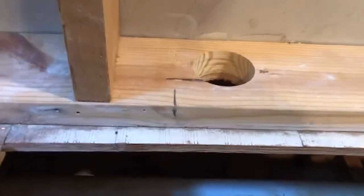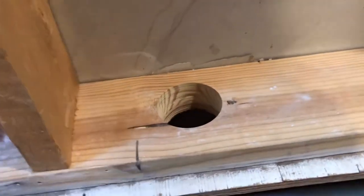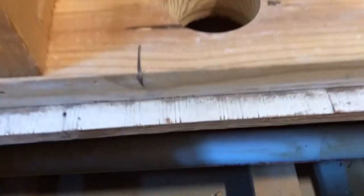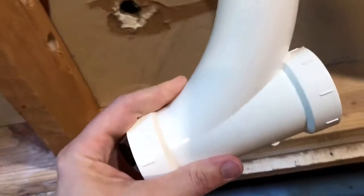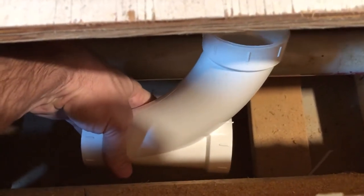Now my holes are drilled and I'm going to start running drain. The first thing I'm going to do is this sink for this bathroom, which is going to go straight through this hole. Instead of trying to turn and bring it out and tie into here or down here, I'm just going to drop it straight down into that existing line that's directly underneath it - you can see down there. For that I'm going to use the sweep. This is two-by-two-by-two. I'll mark and drop it down in here so the sweep goes in the direction of the drain, and I'll line it up with the hole and mark my PVC down below, then cut it.